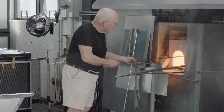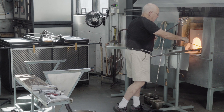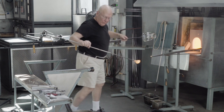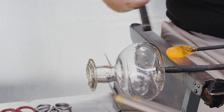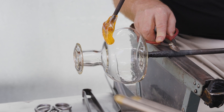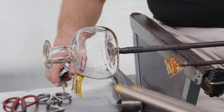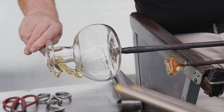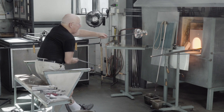Romans almost never made handles with a round cross section — they were nearly always flat, and this strap handle will be flat. I've made a gather on a special punty that has a small T at the end, and this helps make the strap shape. This handle has a dent down the middle. The first attachment point is put on the shoulder, the rod is cut free, and the second attachment point is made. Pushed upward against the neck, the excess is cast off with a thin thread dragged along the hot, larger mass of glass, and it effectively vaporizes the thread.